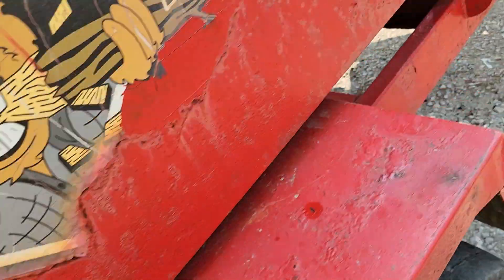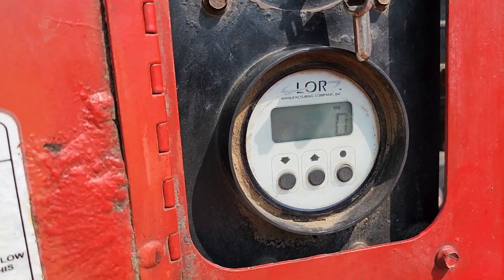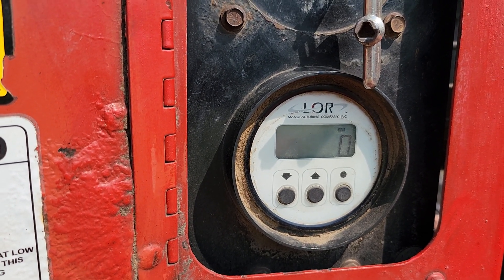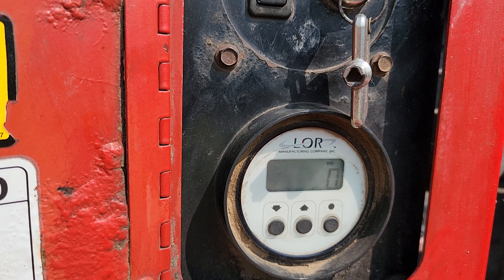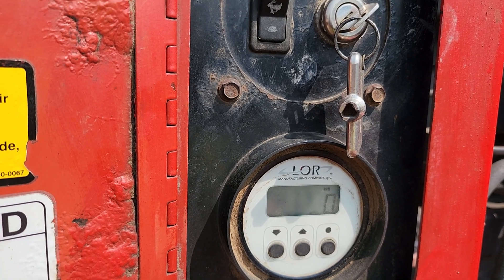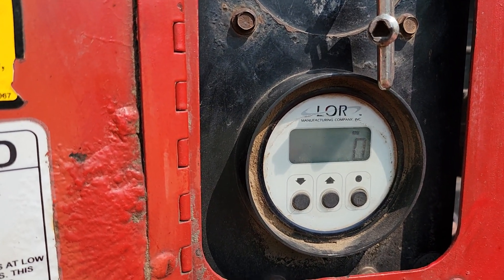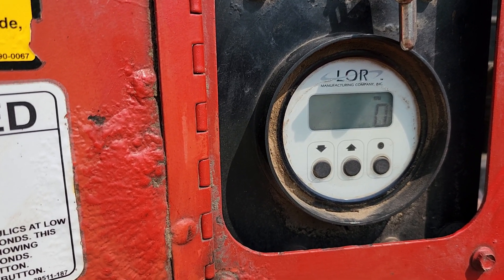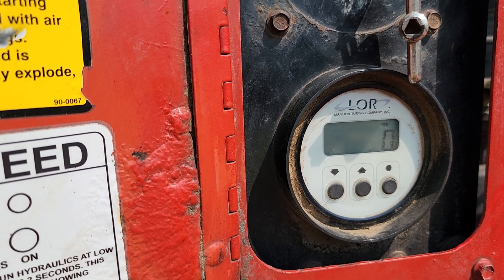Coming back to this side, we have the auto feed in the off position, which means it's always feeding — it's not going to shut down the auto feed. When the auto feed sees too much material coming into the chipper and the RPMs are slowing down, it shuts off the auto feed and lets the RPMs increase. When you shut that feature off, as it is right now, the wheels will always be feeding material in even if the engine is slowing down. That's what the off mode means.